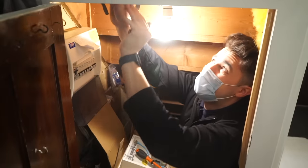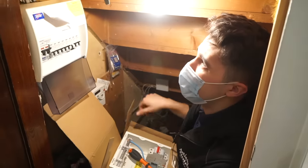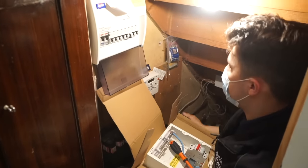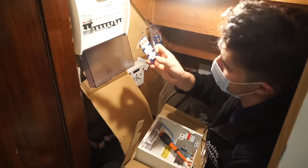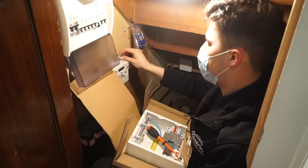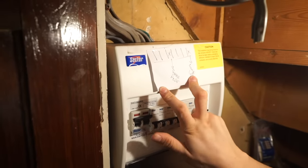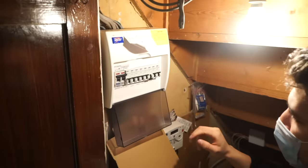So I just have that feeling that it's going to be a nightmare. And I feel like this nail going through the cable there is kind of the writing on the wall. And like I say, they've obviously had an old consumer unit, an old 3036 board or something here recently, because you've got a fairly new fuse wire. So they've had the consumer unit changed. And how's that for labelling? Garage power, garage lights. So that was done recently by an electrician. I mean, I know not everyone's going to be using the Brother label printer, but come on, I think you can do better than that.